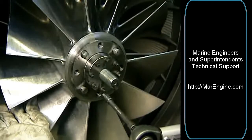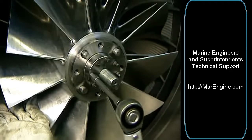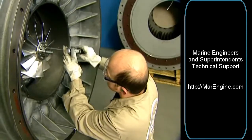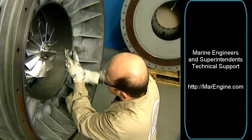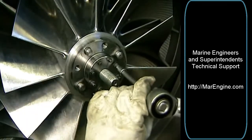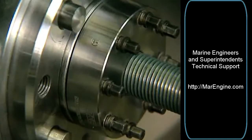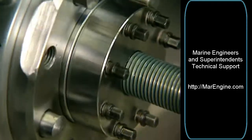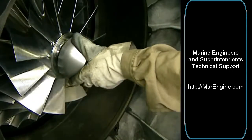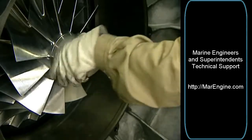Tighten 4 screws over cross with full torque. Tighten the rest of the screws with the same torque. Repeat the tightening in a circular direction until the pressure screws are screwed in, approximately 2 to 3 times over, and the gap between the disc and the nut is nearly equal on all positions. Fasten the spinner with a ring spanner.